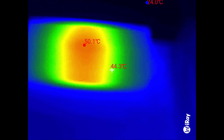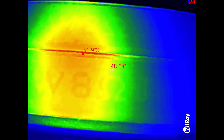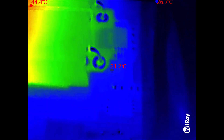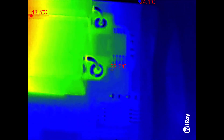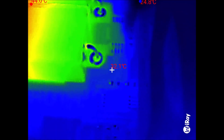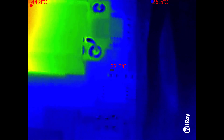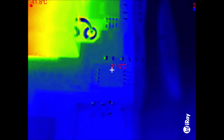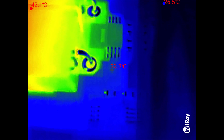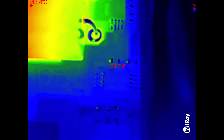The resistors are up to about 50 degrees now — you can see those are the resistors. Now what about these two MOSFETs that I was interested to see whether they're getting warm? One of the MOSFETs is up here, and you can see that that's not being troubled at all. The other one is there — you can see the outline of the MOSFET, you can see its eight legs. But no, they're not getting warm at all, so they must have a nice low on-resistance.